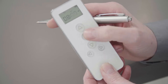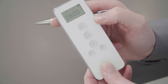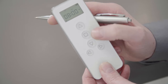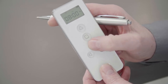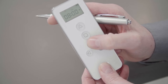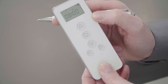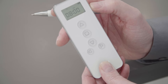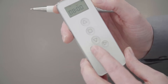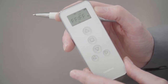When you're happy with the minutes, press stop and the up and down arrows will flash. We want the blinds to go up at eight o'clock. To scroll through the up and down, use the up and down buttons. When we're happy with the time setting — channel one, eight o'clock, Tuesday, blinds going up — press and hold the bottom left button. Number two will appear.